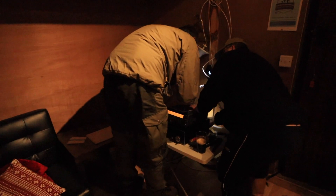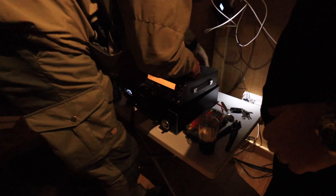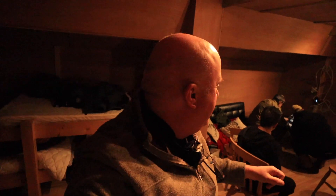We're just trying to solve the problem with the doublet and we think it might be something to do with the tuner itself - it's not switching over when you switch the balanced line. So we've brought the balanced line into a 4:1 balun, and at the back of that we're going to bring in a coax feed line into the back of the tuner. Hopefully that might solve it - theoretically. We'll find out in a few minutes.